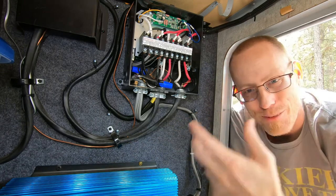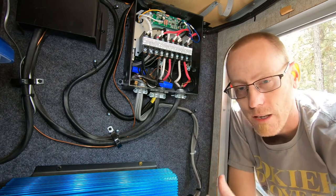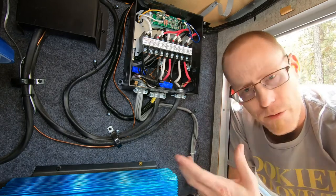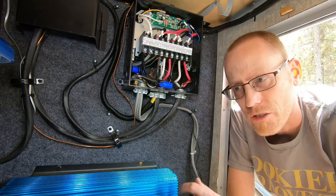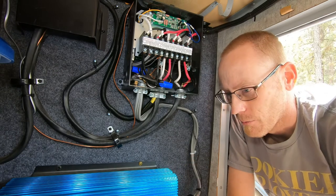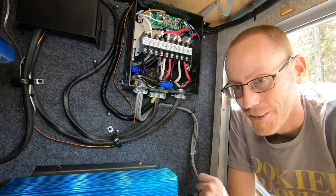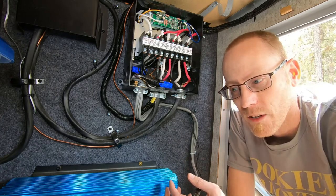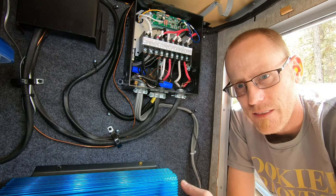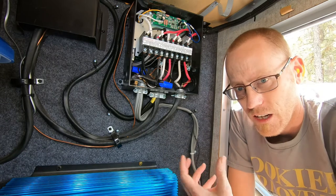But then we go inside, we'll turn on the air conditioner and things will turn off. The inverter starts beeping, and it didn't make a whole lot of sense to me until we were in the blizzard a few weeks ago in March and we had a power outage. We didn't have any air conditioners on, but we did have some space heaters that we forgot to turn off, because those aren't going to be powered by this inverter. But what was happening was the power would click over and it just wasn't keeping things on. Our TV kept jumping on and off.